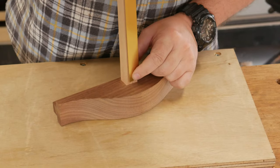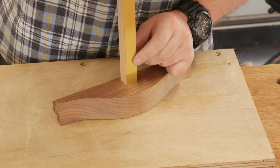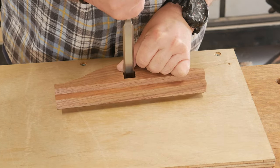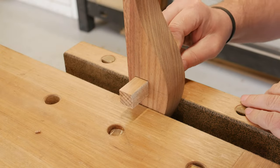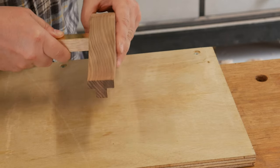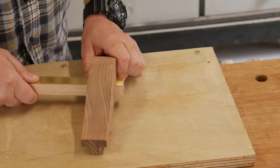The mortise needed to be opened up a bit more to accommodate the beam plus a brass strip, which can easily be picked up in various sizes at hobby shops. A block squared up, double-sided tape, and sandpaper help to dial in that nice fit.